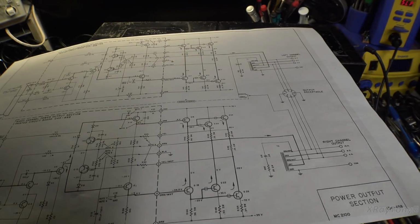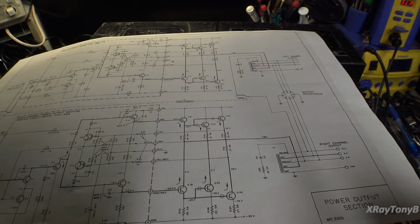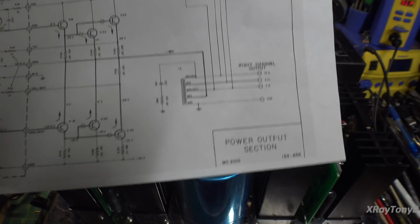So if you look at one of my previous videos I did on signal generators for people who wanted to do tuner alignments on tuners, if you recall, I had shown you a couple of devices to be able to match a signal generator that needs a 50 ohm load to have the correct output to a tuner that only presents a 300 ohm load. So of course your signals are going to be all wrong because the impedance matching is wrong. And we used a special little transformer circuit, or an impedance matching circuit, to fix that. This works on that same principle, really. That's what this is. And so there's all kinds of arguments that putting this in there colors the sound.